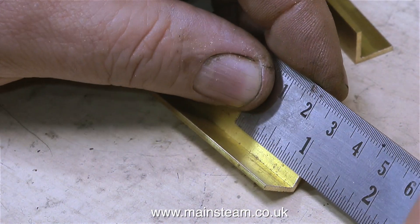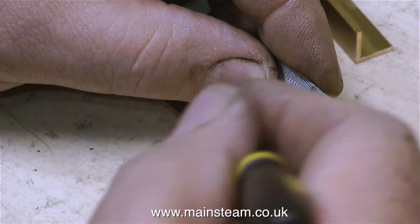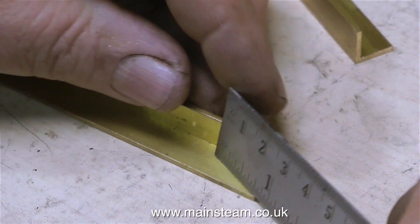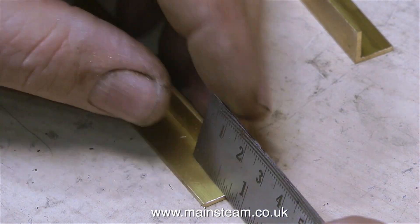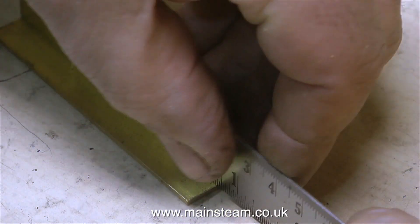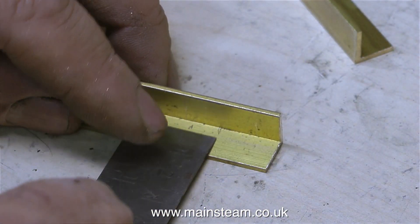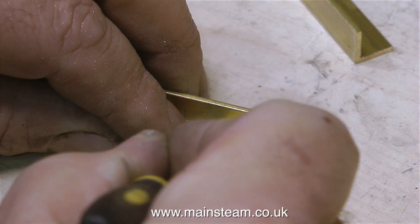You have to think ahead sometimes. I do not want the holes for the baseboard mounting to be in line with the rivet coming the other way, just in case the bolt used to mount the condenser to the baseboard fouls the rivet that sticks out just above it. So I'm putting the hole for the mounting in between two of the rivets.